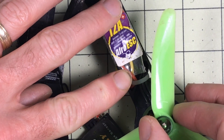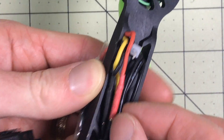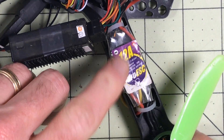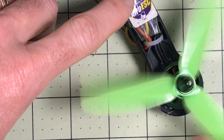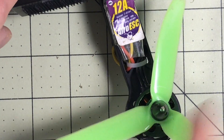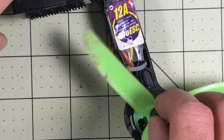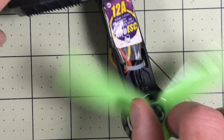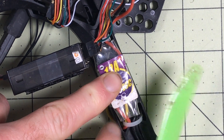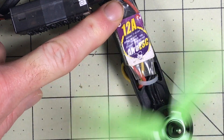From here, there are three wires. On mine, I run them underneath and they connect with barrel connectors to run to the motor. The ESC is the part that tells the motor how it should handle. The motor is obviously the part that spins your prop. This is a brushless motor, meaning there are no brushes to wear out like on older designs from 30 years ago when I was racing RC cars. It provides power through each of these connectors in turn, timed with the motor to make it spin the way you want.